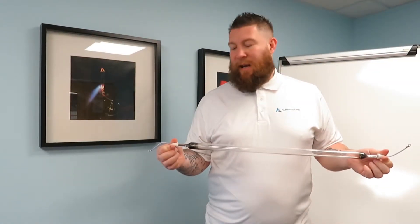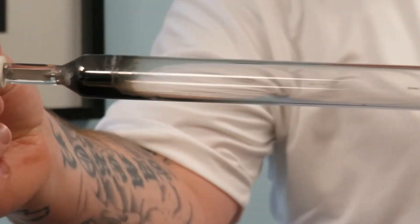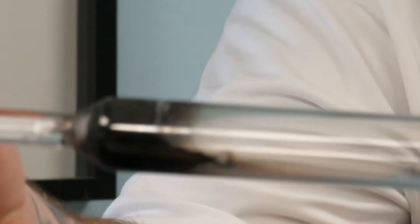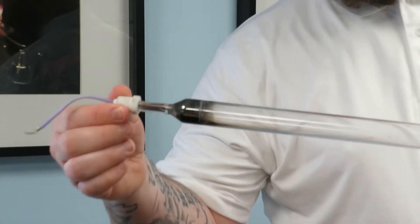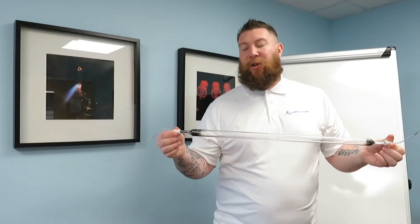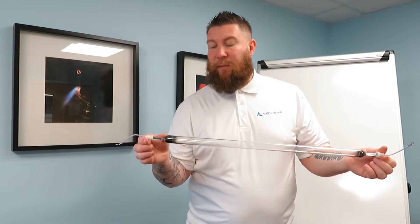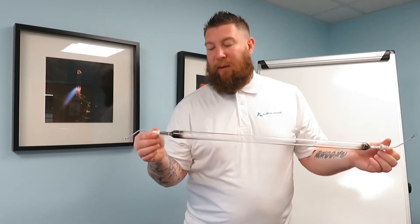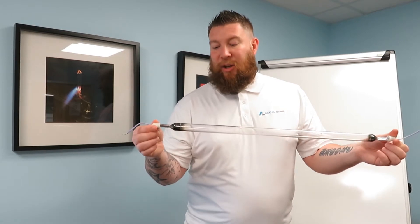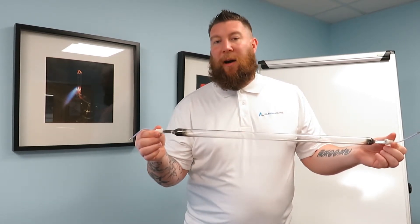The next issue you may encounter is mirroring, which as you can see occurs on the ends of the lamp. That is when there's too much cold air flowing across the lamp, specifically on the ends. This means you're not getting as good a cure, and basically you need to keep the lamps running at above 600 degrees on the ends to ensure that this issue doesn't happen. If you see this issue then you're most likely going to get reduced lamp life hours and UV output.